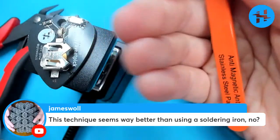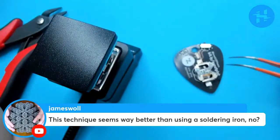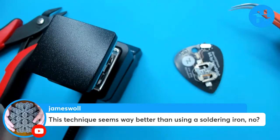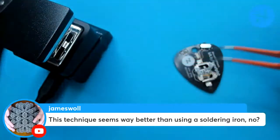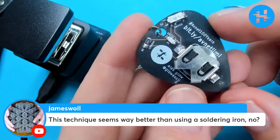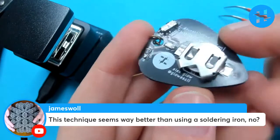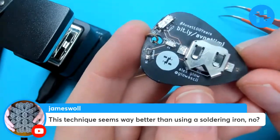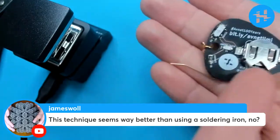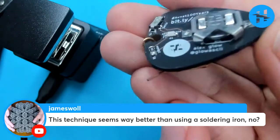And is this cool yet? I'm not going to touch it — just using the back of my hand to feel the air near it. It's definitely cool enough to pull off. We're going to let that cool on this silicone baking mat that I actually use on my desk — it's great for underneath soldering projects because it's going to protect the desk. So that's the difference between hand soldering and solder paste. You can see the hand-soldered one is a lot gunkier. There are reasons you might want to use a soldering iron — you can use one for rework, for example. Or if there are ICs on here, you can either heat it from the bottom but not to melting temperature, and then use a hot air gun to sort of melt individual places selectively on the board, so that you don't focus too much heat on the chip itself. For something like this it doesn't really matter — there are trade-offs.